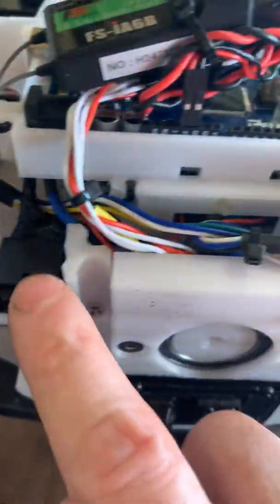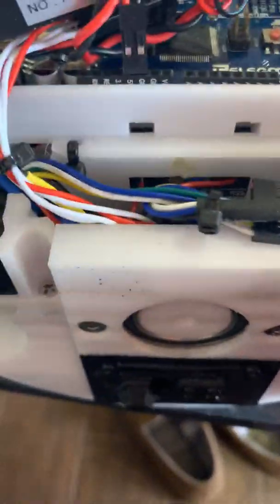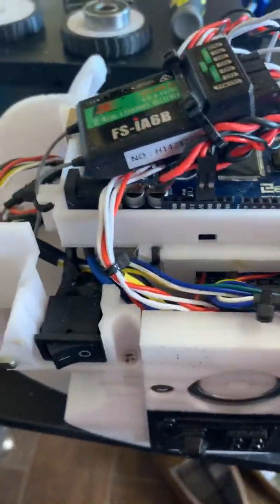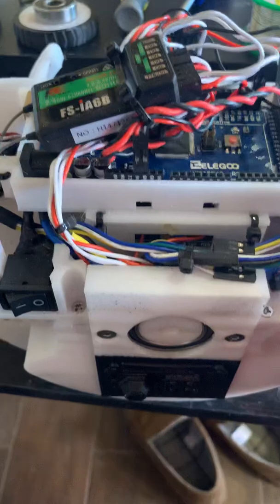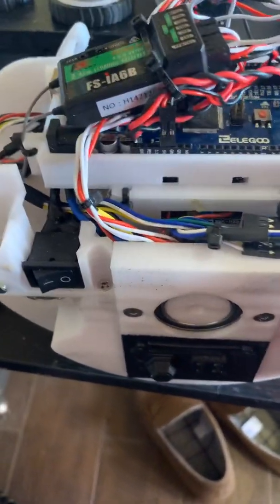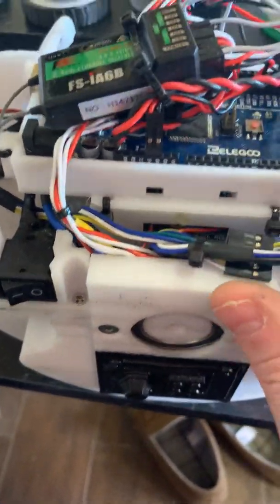So we've got the power switch and the power cable — there are some good pictures on the online guide that show you how to run that. What you're doing is running the two batteries in series, so you're kicking out around 14 volts or so, which is giving it the main power. The voltage does drop a little bit when it goes through the motor controller.